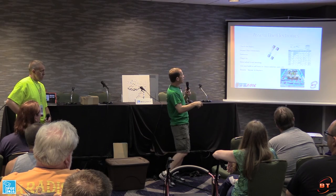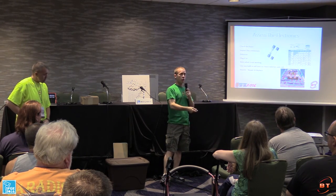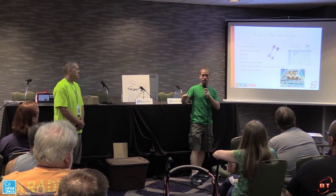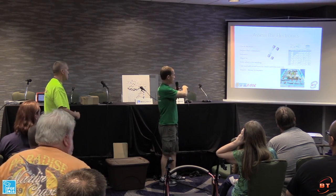All right? So I'll work through all that, and there's something similar in most manuals for all of your coils. So I'll get into the self-tests, and I'll activate all the coils, and then I'll mark anything that has problems, and then that's something that I know I need to work with later. And then finally, boards, repair versus replace.